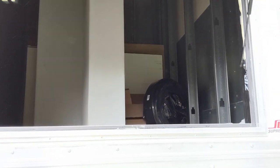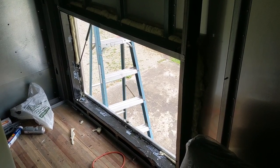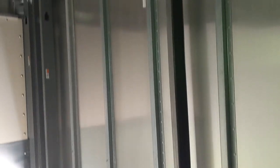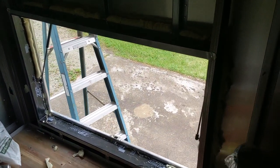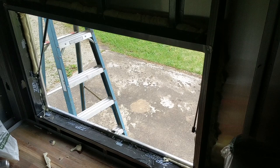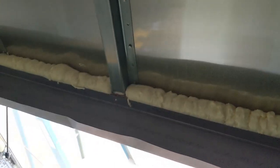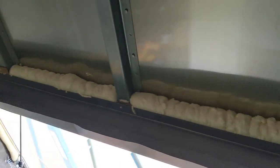Let's go take a look at that from the inside. Here's what the baggage door looks like from the inside. I framed it out using standard steel studs and then used flashing tape to bridge between the studs and the hole that I cut out of the wall, and then came back in behind that with spray foam to support the flashing tape. That's worked pretty well.